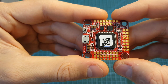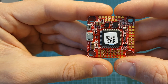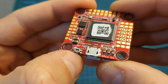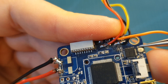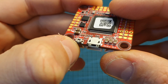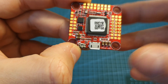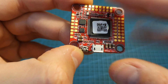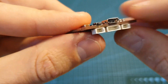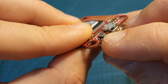The flight controller also features five free UART ports, which is probably more than you'll ever need. Next to the micro USB port you can find the boot button. I really like the form of this button — the other type can fall off pretty easily. Its positioning is also great: when the button is on the side it's easy to press and enter DFU mode even when the quadcopter is fully assembled, unlike buttons on top that can be hard to access especially with a VTX mounted above.